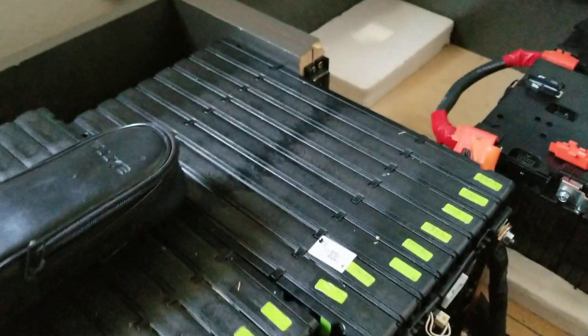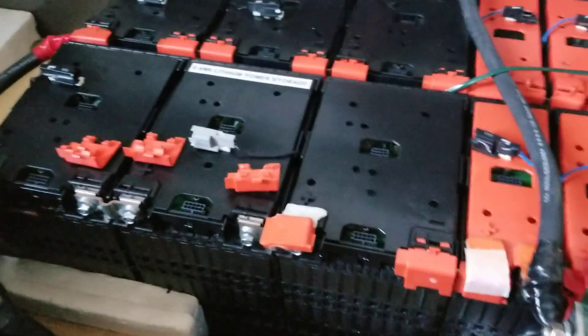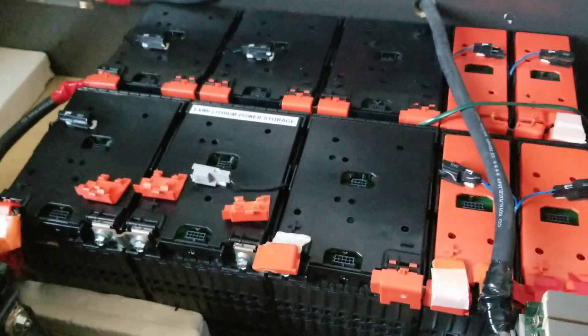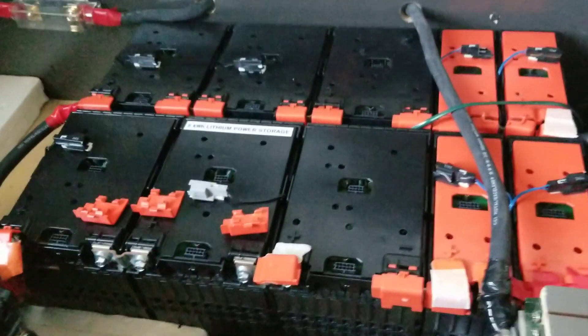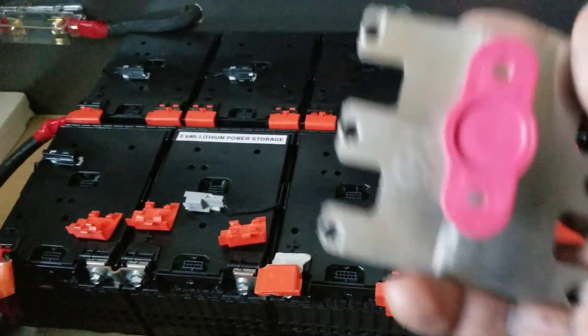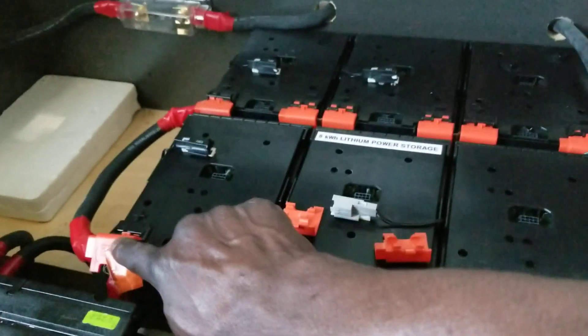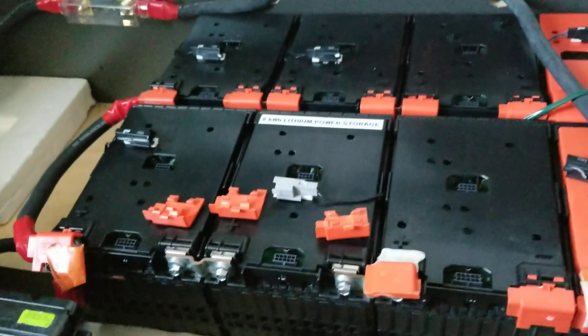Guys, I just want to tell you — these are all tied with the Chrysler Pacifica cells here, which are LG cells, along with the others. The batteries are well balanced. I was a little worried because the interconnect is what normally throws batteries off balance when you parallel them. I encourage you to parallel them with a bus bar so you can have a very accurate reading.